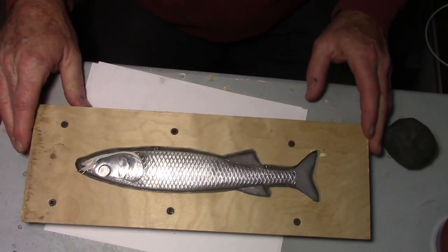Just another little tip about using mold bases and doing molds. If you're going to pour 15 or 20 of these, or maybe 100 of them, I don't know. You're not going to get 100 out of one pour of rubber, but you might get 40 or 50. And who knows, some guys might be getting that. I'm not. I get about 50 pours and the rubber starts going bad, if I'm lucky. And I treat my mold good. Use a lot of mold release. So, all right, let's get started.